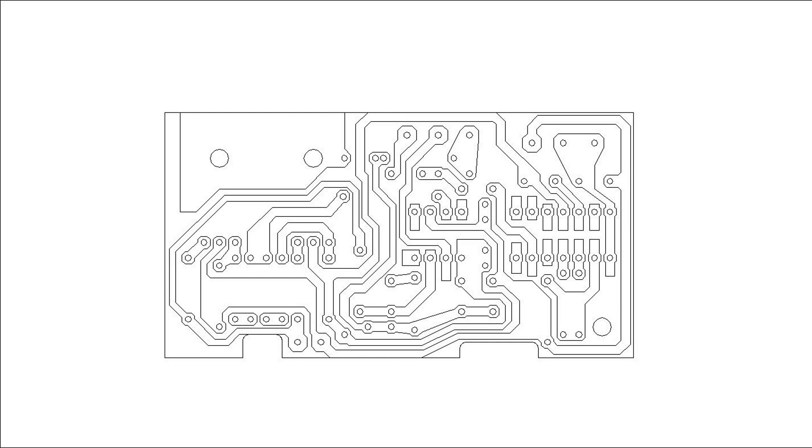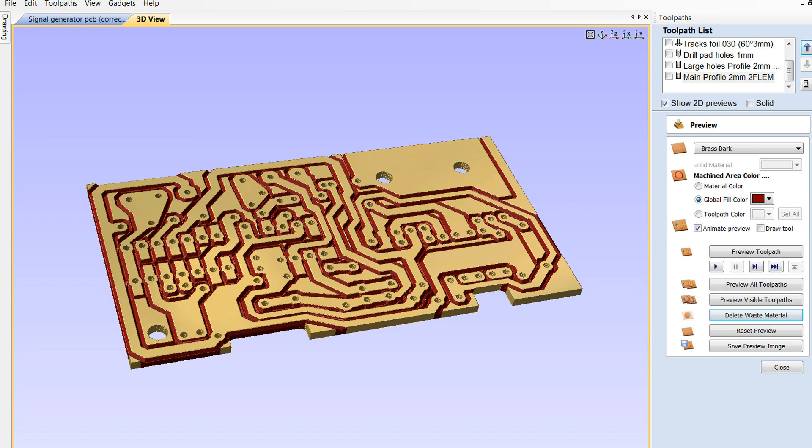Here are a few of the various layers that can be achieved with this system. What we do next is produce DXF copies of these drawings, which can be used in Vectric VCarve Pro that will produce the G-code for milling out these parts. What you're looking at now is the VCarve Pro 3D depiction of the circuit board.